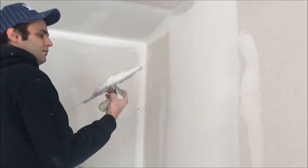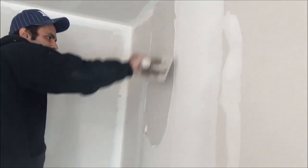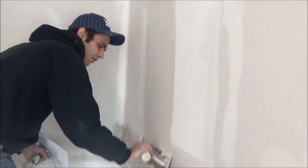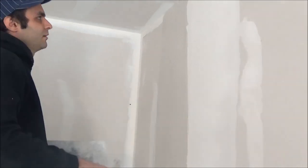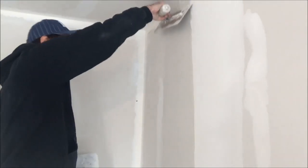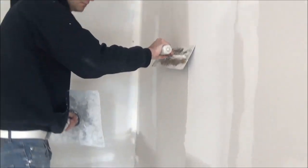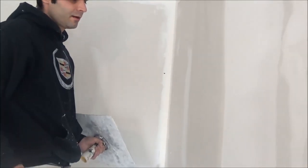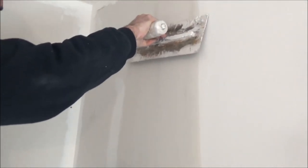You're going to do the same thing as on the first coat: run the mud all the way to the flat, then wipe the edge, wipe the middle. The trick here is to leave no mud on this section here but leave enough on the top. You go like this — you don't press — and now you press hard.